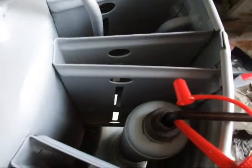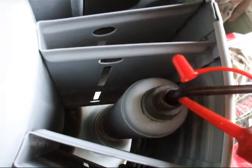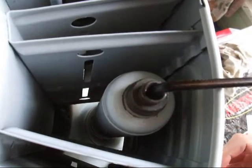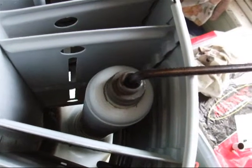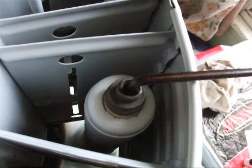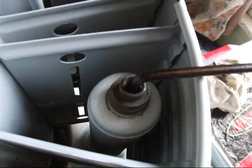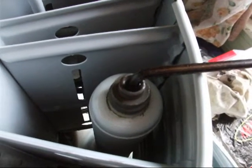I used to use sewing machine oil. I'll put enough drops in there to come almost up to the top. The reason we're doing that is to find out if the condenser is operating at above atmospheric pressure or below. We want it running above atmospheric pressure so that the non-condensable gases are pushed out, rather than having air sucked in, which would only make it worse.